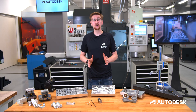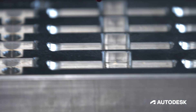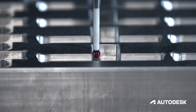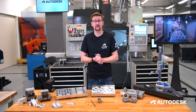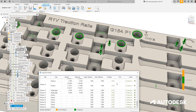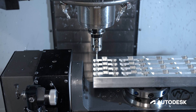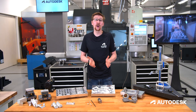Your probe can do so much more than just set your WCS. We can actually utilize the power of our probes to catch in-process variation and errors. We can use probe geometry in Fusion 360 to inspect features as they're being created, so you're no longer spending time adding machining processes to a part that's already scrap. You can also use probe geometry to give the tools your machines need to be confident about the quality of the parts coming off the machine. No longer is the machine going to be stood still because our inspector in our CMM room doesn't work on a night shift.